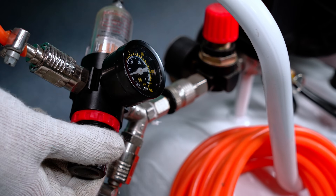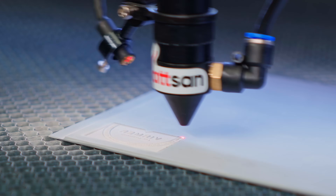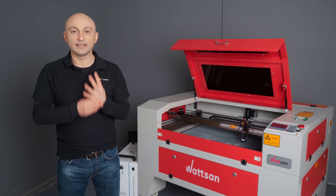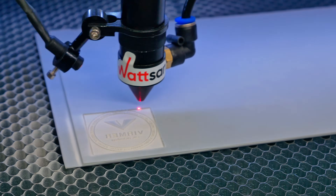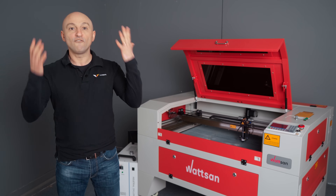Third, make sure that the air blower is switched on. This feature prevents your lenses from becoming coated with dirt and overheating. Fourth, check the depth settings — to prevent ink smudging on the engraved part and residue on the material, make sure the engraved depth is greater than half the thickness of the rubber. Your layout is now finished.